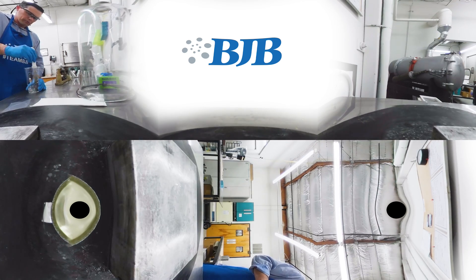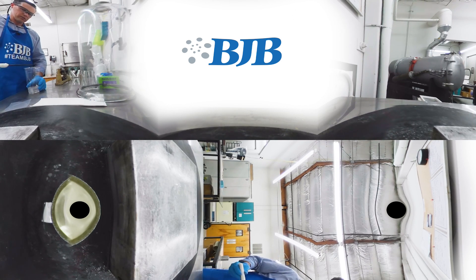When you mix any two-part material — A and B — you will inevitably mix in air bubbles. If you don't vacuum degass the material and remove those air bubbles, you will end up with a carbonated soda look as opposed to a nice, clear cast system.